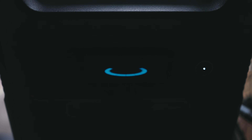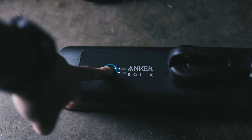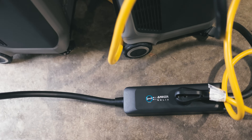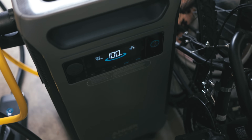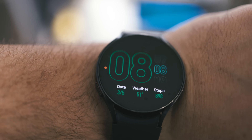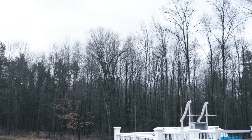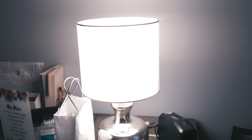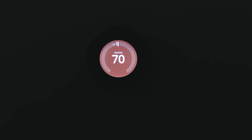Everything is ready to go. I hit the power on the first box, hold it in for a second, it kicks on. Go to the second box and kick that on. Now I go to the double power hub, press down, hold the button for a couple of seconds, and this starts pushing power into my box — the light comes on. Now everything in the house is running completely off of these boxes. I have no power coming in. What time is it? It's 8:08 AM. It's 51 degrees and gloomy, which means my furnace is going to kick on and I won't be able to hook solar up. All of my lights are on — everything on my house is now running completely off of the two 3800s.